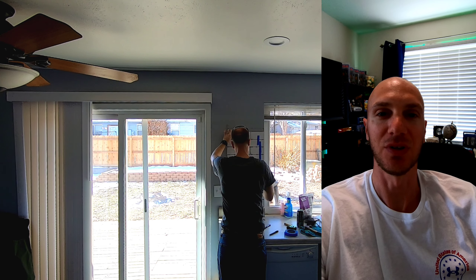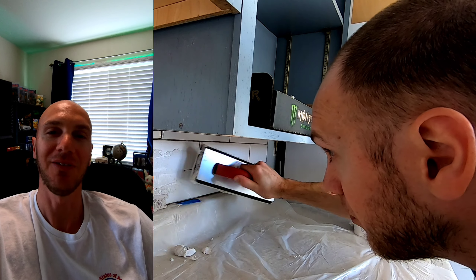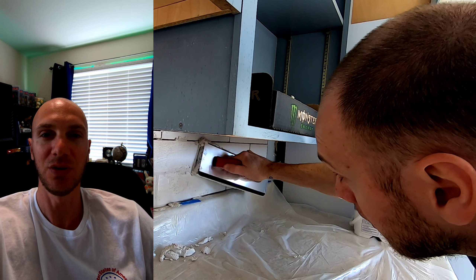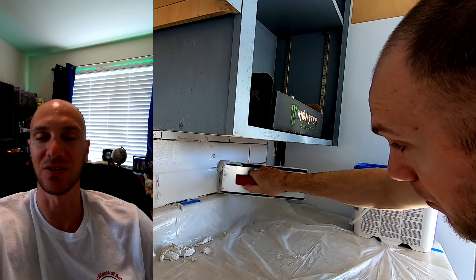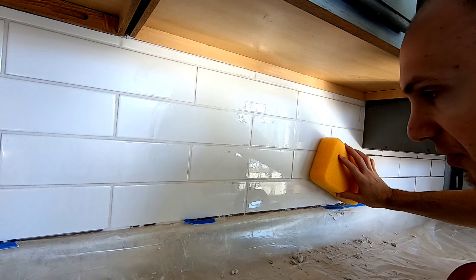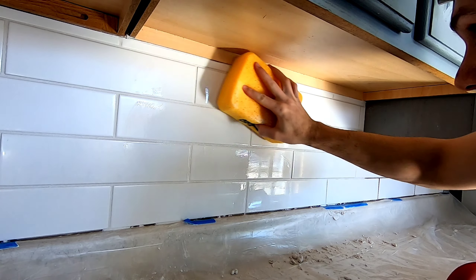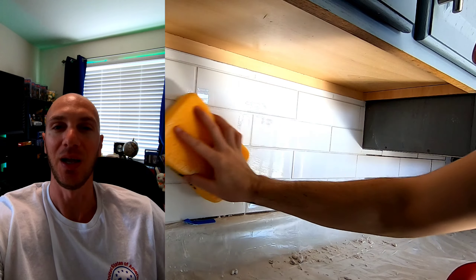Transition profiles — I would have never remembered that. The hardest part about backsplash is getting started and making sure you have a flat, level surface to work with. But as you can see, I'm already halfway up the wall. Subway tiles are very easy to work with. All you need is a nice tile cutter — you can get one for about 70 bucks. It also helps to have an angle grinder for making cuts behind outlets. You're going to need some tile mortar to glue it to the wall, a sealer for the last step, and a high-quality grout. I always go for the pre-mixed stuff — it's just so much easier to work with.